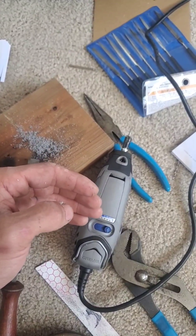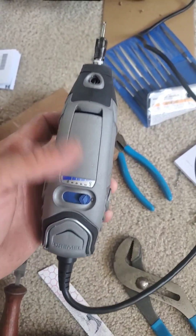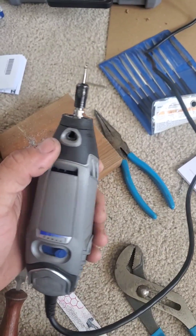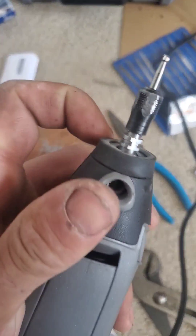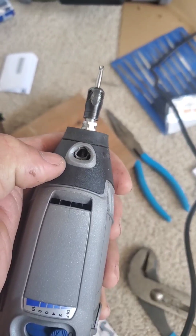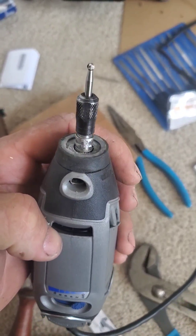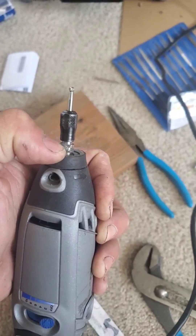It's not even a real McCoy connection. It made me sick, what I paid for it, for it to be such a piece of junk. It works — it has a good motor — but everything else around it is junk. Why they didn't harden this steel part right here, and why they didn't harden that little arbor lock peg, I can't even understand what they were going for there. I had to grind this down to get enough room on the arbor to get pliers on.